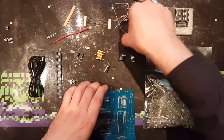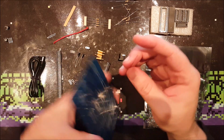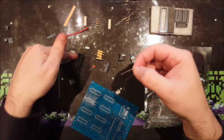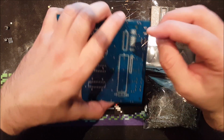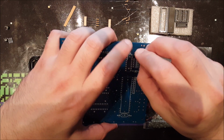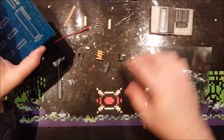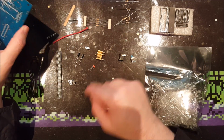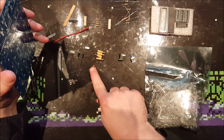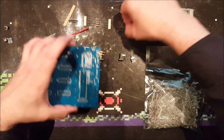So let's put the resistors in first. The polarity doesn't matter for the resistor, left or right, it doesn't care, unlike the electrolytic capacitors over there. But those are the only, no, I'm not gonna tell you lies now. Those are not the only components which mind the polarity, but also this resistor array has a pin 1, the ICs of course, and the electrolytic capacitors. These normal ceramic disc capacitors don't mind the polarity also.